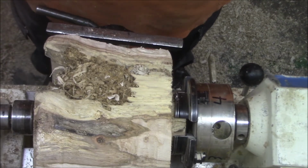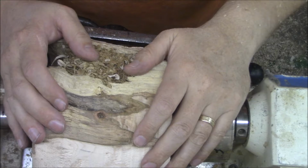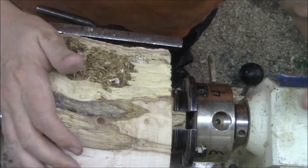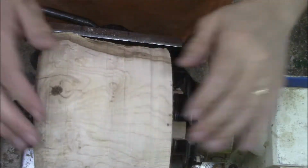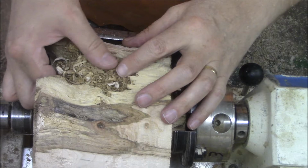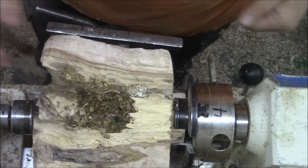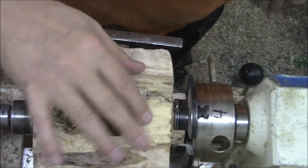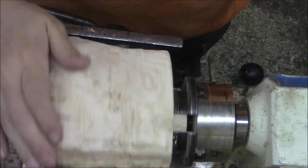You missed a bit, just out of necessity. The faceplate really wasn't holding well enough to be stable and be safe. So I cut off a bit, got it mounted in the chuck now with a pretty solid tenon. So I think I should be good. My glued in pieces have decided they're no longer going to be stabilizing anything for me, which is fine. I'm hoping to get something out of this, and if you're watching, that means I did.